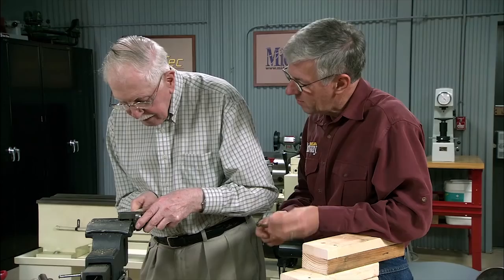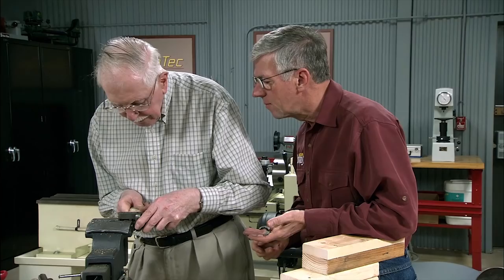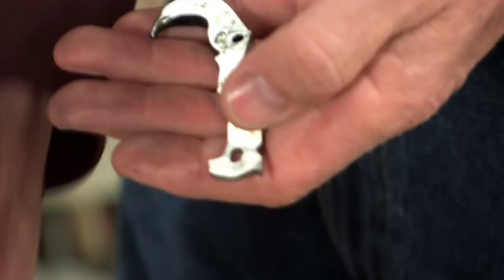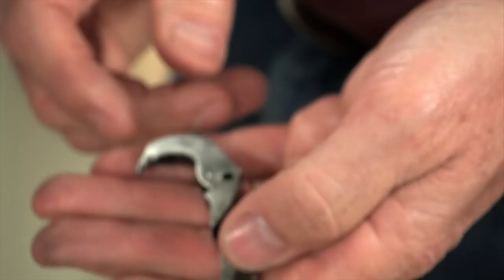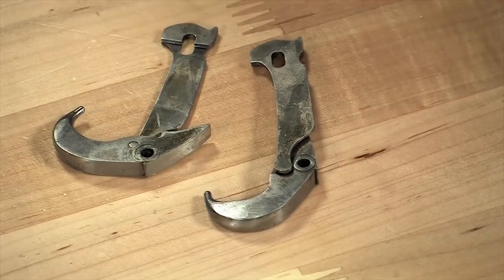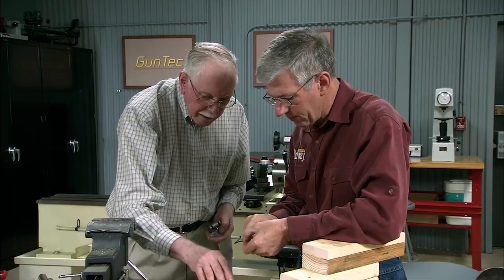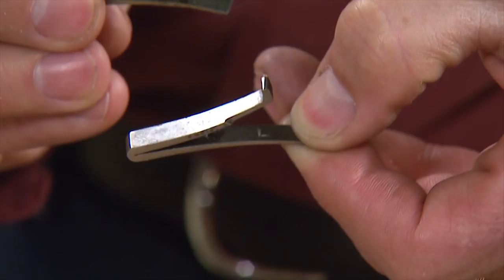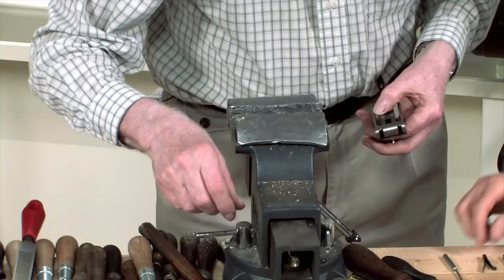Press the pressure on the front of the hammer. Now it comes under control until you drop it. And there's the other side. You can't mix them up — they're marked, the legs in there too. The mainsprings are marked, right? Yes, you can't mix them up because of that cutout on the side. The cutout on the side is there so that the spring won't fall on the sides.